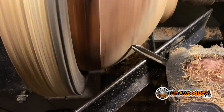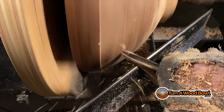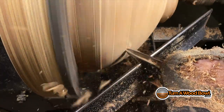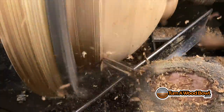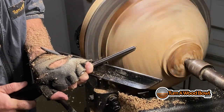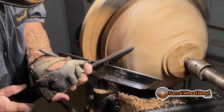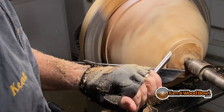I'm not going to go all the way up to the padding on this jam chuck. Instead, I'll work up close to it and clean up the rim of the bowl when we reverse it in just a few moments. Just make nice light push cuts. If you notice, I have the bowl gouge rotated to the left so that the nose is pointing at about the 10 o'clock position. The flute is pretty open here, and that's okay because I'm making a very light pass. If I were making a deeper, more aggressive pass, this is a good way to get a catch with the flute open like that. I'm doing more shear scraping to smooth the surface and connect those transitions — that's par for the course. You'll want to work in sections and gradually work down the side of the bowl until you get the shape and finish you're looking for.